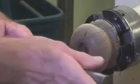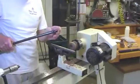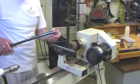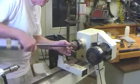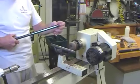I've got a tool rest here with a one inch steel diameter, and I ground a little flat on it, drilled and tapped it for a 5/16 bolt. And I got a 5/16 eyebolt, which is about the same size as a 3/4 inch rod. You just tap the bolt onto the rod, and that turns and gives you complete freedom of movement. If you have a 3/4 bar with a 5/16 set screw and a hole that will take a 1/4 inch machine tool bit, then this will just slide in and out.